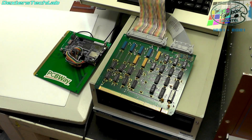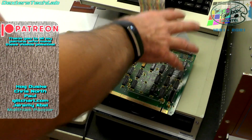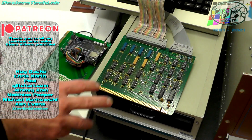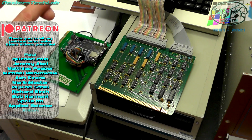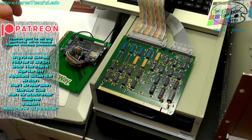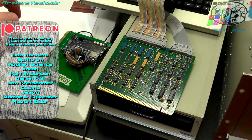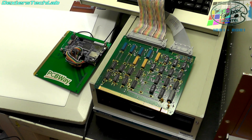So let's just refresh our memories on what this card is actually doing in the DPB and why we need it. This card here sits in the back of the paint box and it's the interface to the SMD bus which runs out to the hard disk and the floppy disk. You can have up to 8 drives on a Quantel paint box — a mixture of floppy disks and hard disks of various different types. They are all roughly known as Winchester drives, an old name for big old hard disks. They use the SMD interface which predates things like MFM, RLL drives and of course SCSI. So this goes way back into the 1970s — it's a much older format.